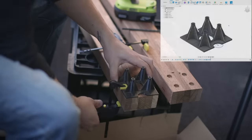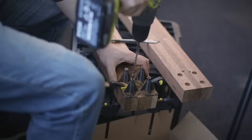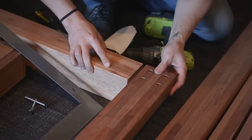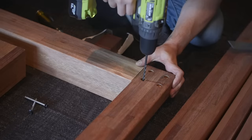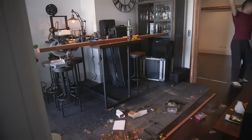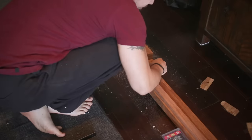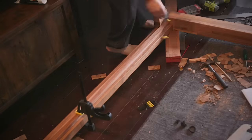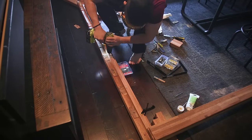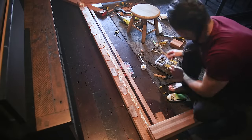I 3D printed a jig to make sure that my drill holes were all straight and consistent. And because some of these would be pressed up against the wall, I used a spade bit to recess the bolt heads. From here I lined up the bearers with the posts and fastened them together with coach screws. Then it was time to turn the frame upside down to work on the inside. I propped the frame slightly off the ground to position the inside bearer - the piece of timber which will be supporting all of the slats, so it needed to be very firmly attached. I drilled pilot holes before applying the glue, and then screwed them firmly together.